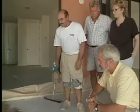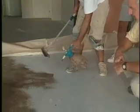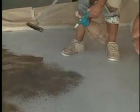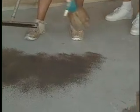Well, I apply the stain with just these hand pump applicators. Go ahead and show us. And I try to make drift patterns. Now, you've used a brown stain in here, right? That's correct. Do I assume you can go with any color you want? Oh, yeah. Red, green, yellow, or in between? Hundreds of colors available. And then this is kind of like a little skimmer. Right. Squeegee, to help move the material.